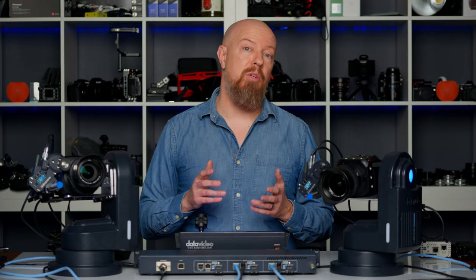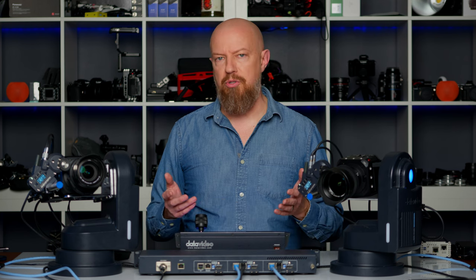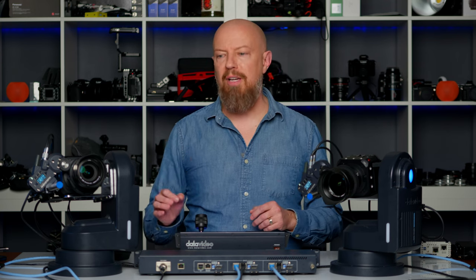Next, let's talk about camera selection. You can put pretty much any camera you want on these PTZ heads, but for those of you who are fans of this channel and might have seen my 5x BGH1 video before, you already know why the BGH1, or the BS1H, is the perfect camera for this solution. These cameras can be controlled completely over a network, over an Ethernet cable. This means that you can run another Ethernet cable from the camera into a network switch, and then hook up your Mac or PC running Lumix Tether software to that same network, and have complete control over those cameras.